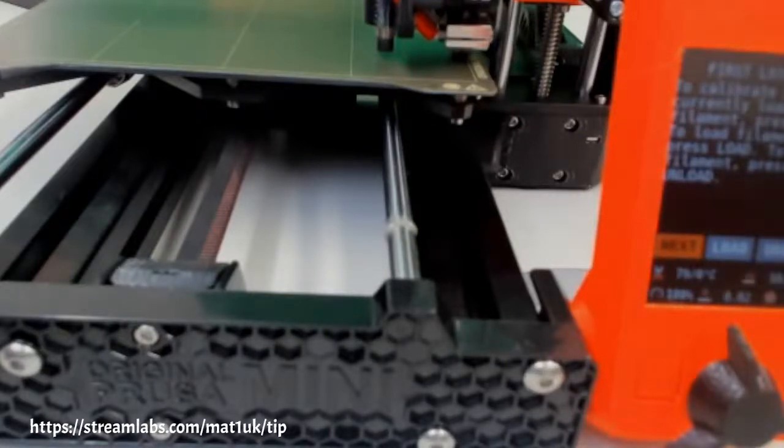There are several systems available there, most of them that work over Wi-Fi. There's a thing called Octoprint, which uses a Raspberry Pi, and you put firmware onto the Raspberry Pi, and then you plug the Raspberry Pi into the motherboard of the printer, and that enables you to remotely look at the temperatures of the printer, how long it's been printing, how long it's going to print. You can fit a webcam to it as well, so you can actually watch your printer printing while you're not there. You can pretty much do everything with Octoprint now.